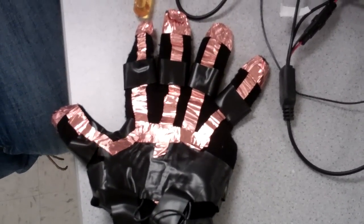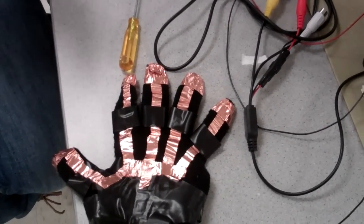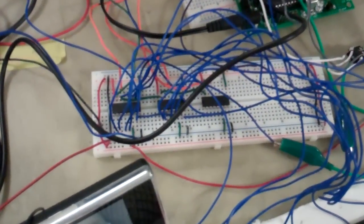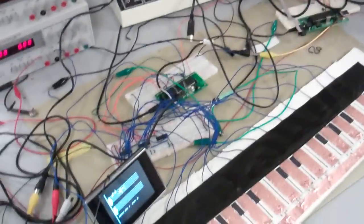Tell me about the keyboard. The keyboard has up to 14 keys so we can play two octaves on it. We built our own keyboard. The keys are charged to about 5 volts and to play you have to wear gloves — when playing on a key the microcontroller will detect a change in the input and will know what keys are pressed. We also use two parallel-in serial-out shift registers to simplify the interface between the keyboard and the microcontroller, so now we only need two serial lines.